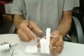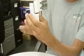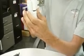And if you do that, you want to start on the bottom hinge, get all the height out of that, and then the next hinge up, you're going to see a little bit of a gap between here. And the next hinge up, you just tighten it until it gets tight, because all the weight's going to be carried by the bottom hinge. Then you just tighten that screw up until it gets just a little bit tight to take a little bit of the pressure off on the other one.